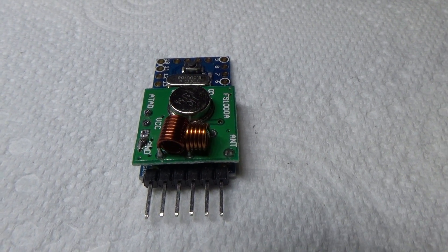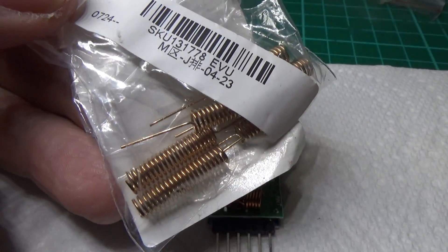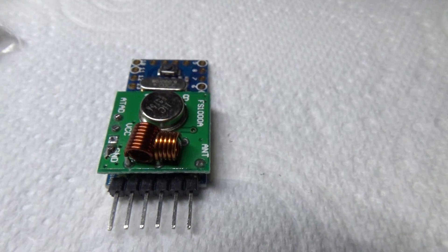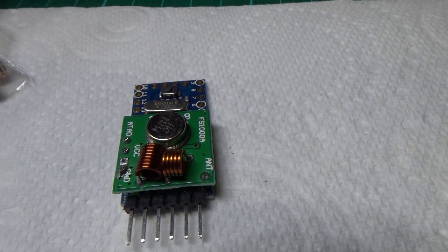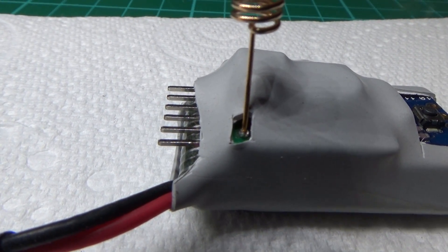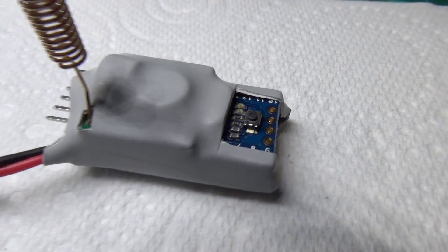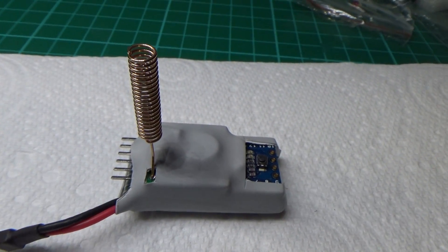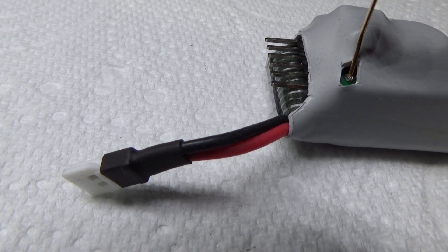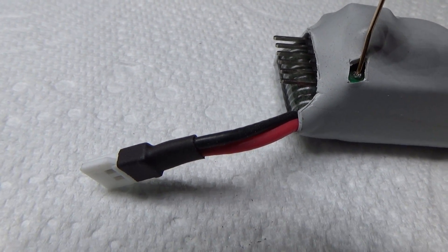You can put the antenna on now and leave it just bare — it doesn't really matter. But what I actually do is tin the antenna pad up, then heat shrink it, and then cut a hole, which I'll show you now. As you can see I've cut a little hole in there, and I've also cut a little hole for the reset and the LEDs. I'm going to put heat shrink round the antenna and then put a standard Futaba servo connector onto the end of the battery.